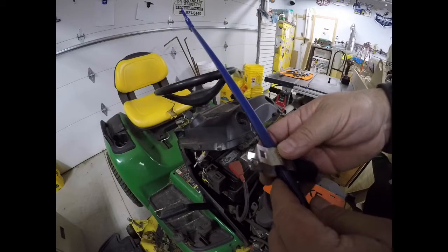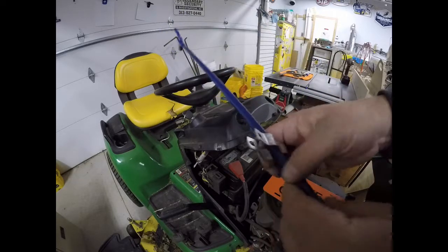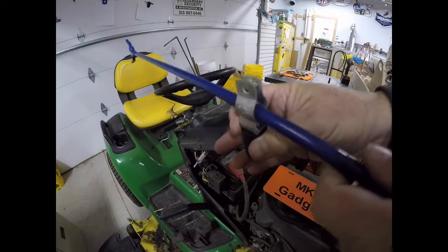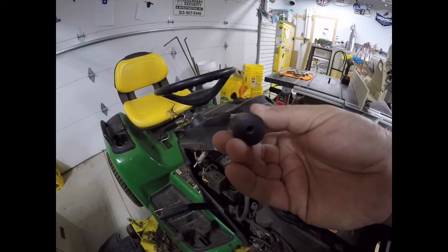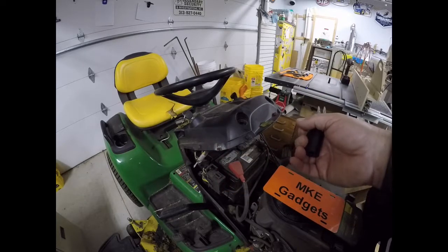If your yard is like my yard, this might bounce out, but this is really soft steel, and you can kind of pinch it, and then it won't come out as you go over the bumps. And then when you need it, it just pulls right through. Make this little piece of nylon. We're going to go to the lathe, face it, drill it, tap it, and then install it back here at the lawnmower. Next stop is the lathe.